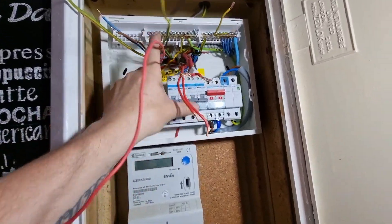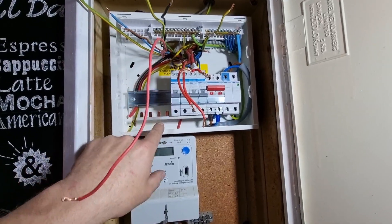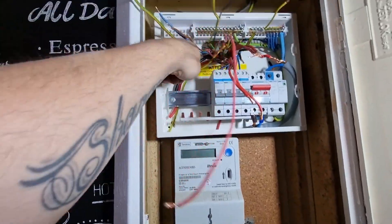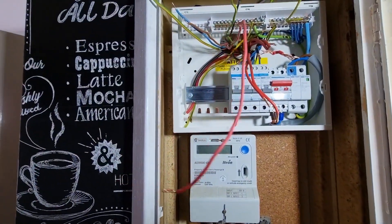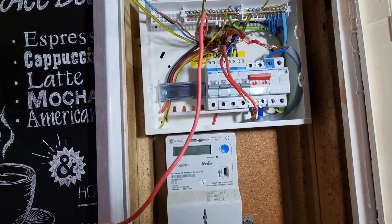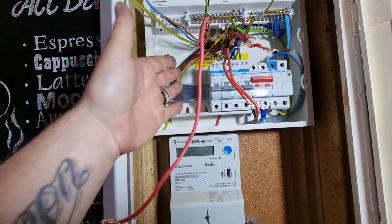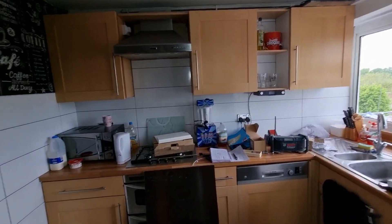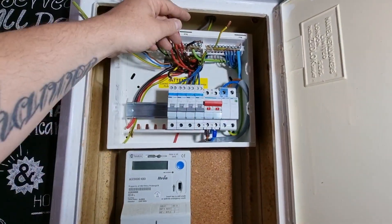Welcome back. The board is now fixed inside the cupboard and I've put the RCBOs in that we need. As you can see there aren't many circuits. The circuits at the back here are all redundant — this one is up in the loft, it's a shower supply, so at any point it could potentially be reinstalled. There's nothing to stop it being put into an RCBO, so if they ever change their mind and want to reuse that cable I've left it in here. The same goes for the cooker supply, although the cooker switch has been hidden so the chances of that getting put back in are quite slim.